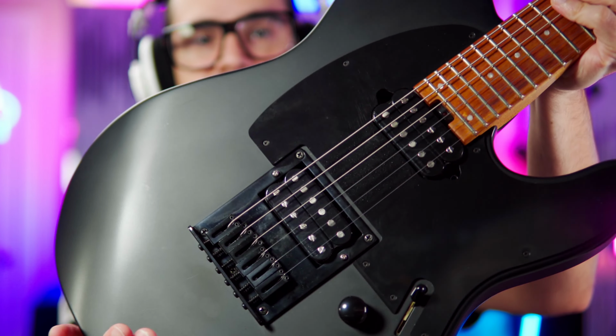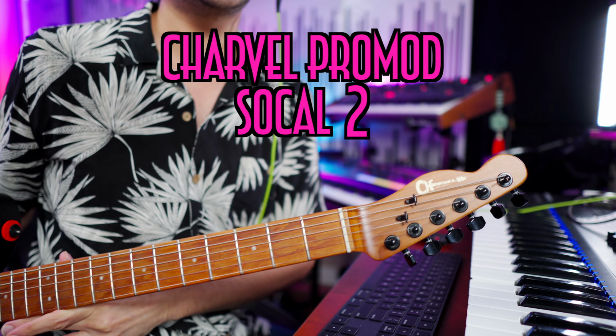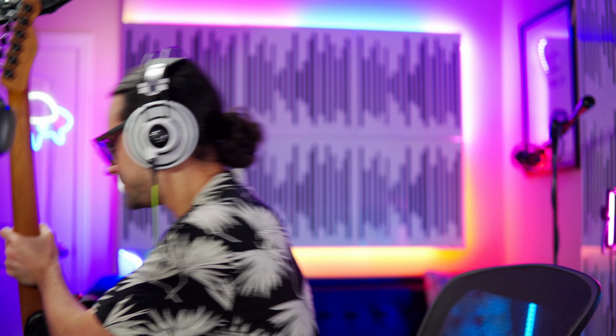So to begin with, now that I said that we have low or moderately low output pickups in this guitar, that means that there are guitars that have really high output pickups, like for example, this monster right here. This guitar has one of the hottest pickups I've ever heard in a guitar, and it really does push the amps a lot. Maybe not as much as the numbers would reflect, but it does. So something that would sound clean in that guitar, with this guitar would be very overdriven. Having said that, I want you to take into consideration that once you change guitar, let's say if you were already overloading your guitar interface and you get a higher output pickup, you're going to be overloading even more. And what's going to end up happening is that you're going to have distortion before you ever hit the amp.